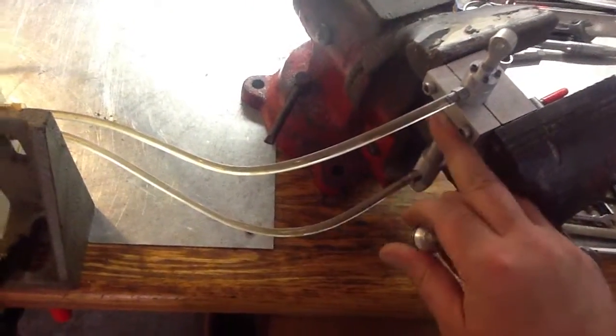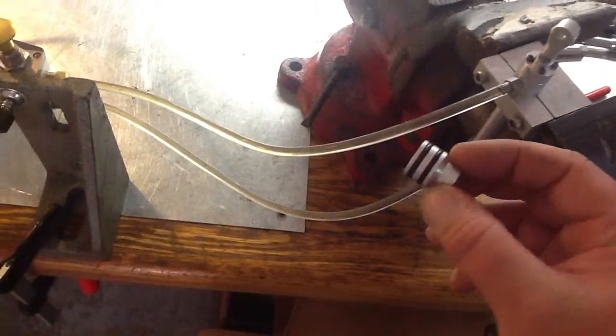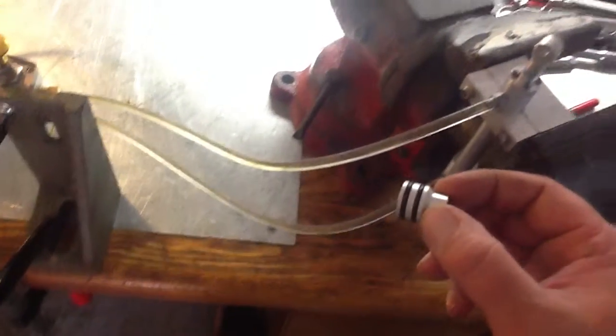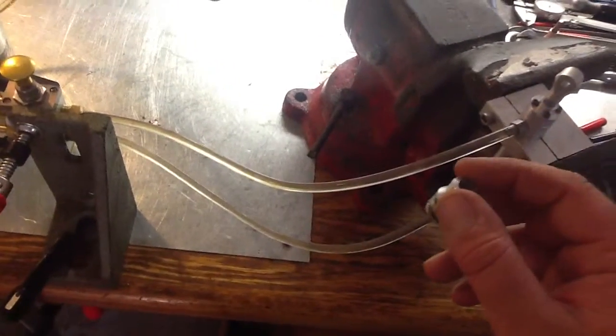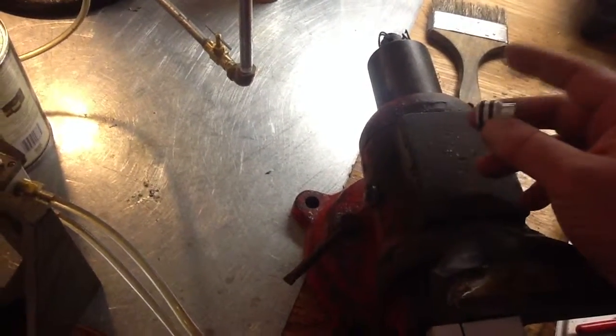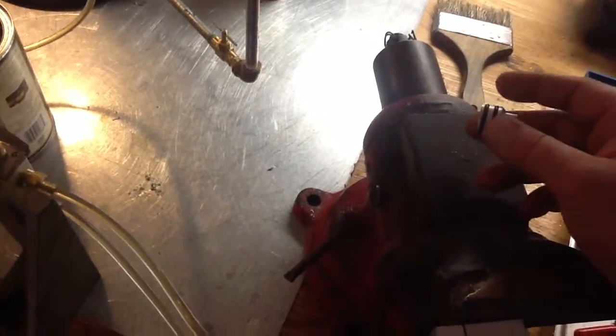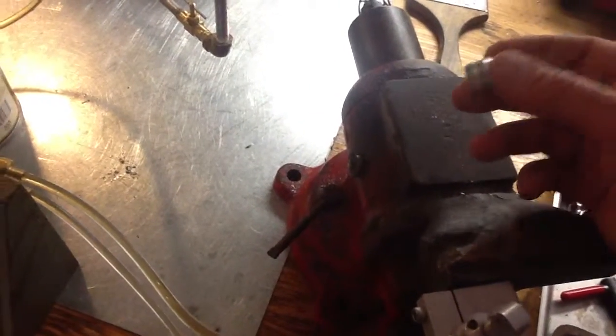I'll show you kind of the design for the piston — the part that's connected to the rod that goes up and down in here that blocks the cylinder from either side — it's essentially like this. This is from a bigger one that I was making that I messed up the bore for. So one of these is just connected onto the rod, and it's just got two grooves in it and a hole through it so you can connect to the rod. The grooves are fairly precisely placed and the O-rings are on there. And the rod has a shoulder on it and a thread and stuff so you can connect that.